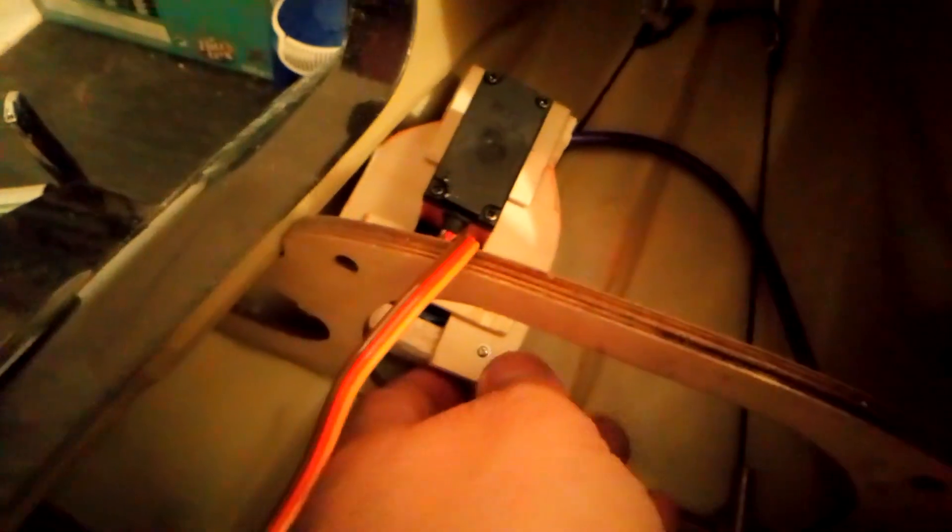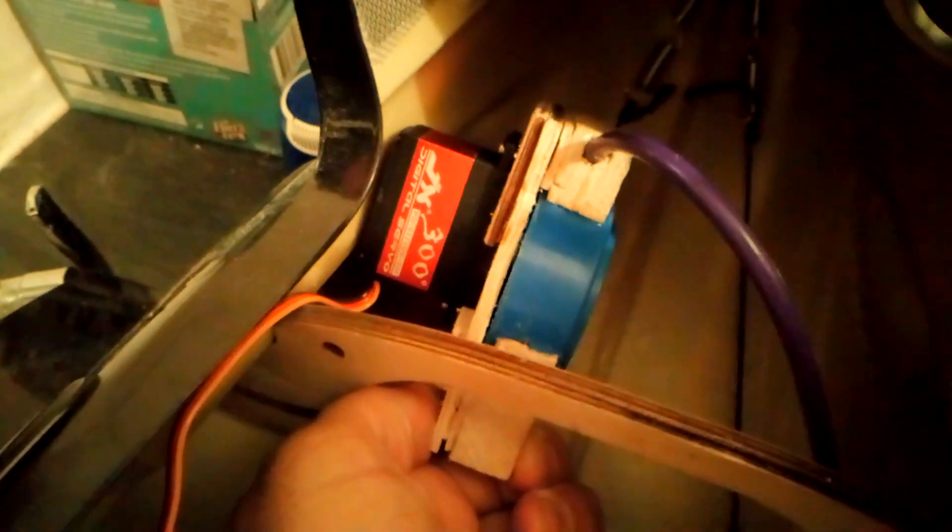If I show you the mechanism inside, it makes it all happen. We've basically got the side nacelle driven on a single servo, temporarily mounted on a rather crude bracket. The actual gun mechanism is activated through this flexible cable — it's a bike cable — onto a servo that wraps the cable around a drum which is modified from an old plastic cylinder. It's a 300 degree rotation servo on there.